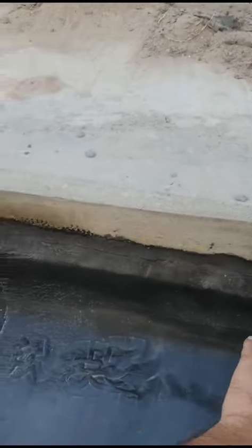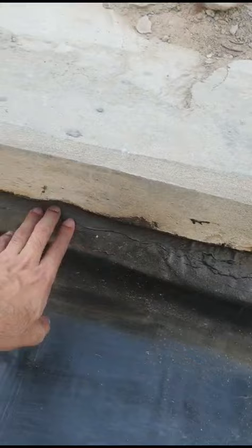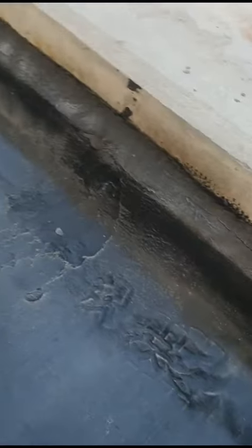The membrane has gone properly inside and is properly terminated. I am able to see if there are basically any damages. You have to check its joints — as you can see, it is properly torched.